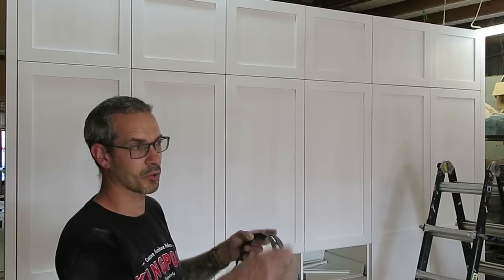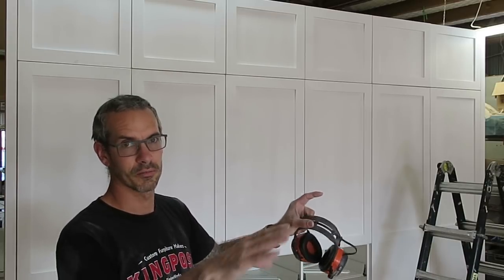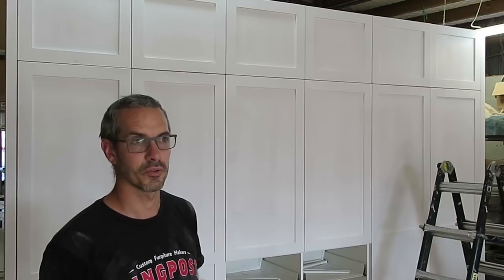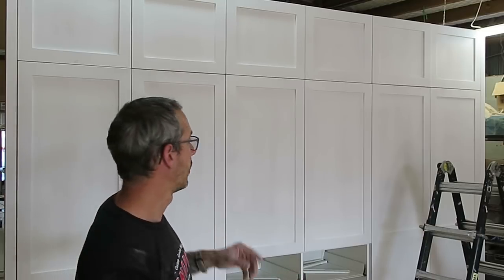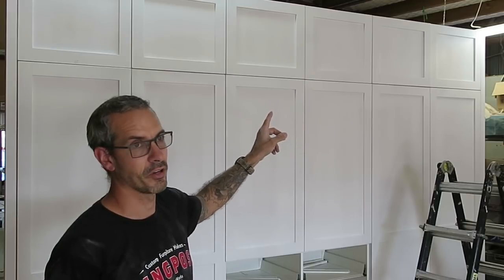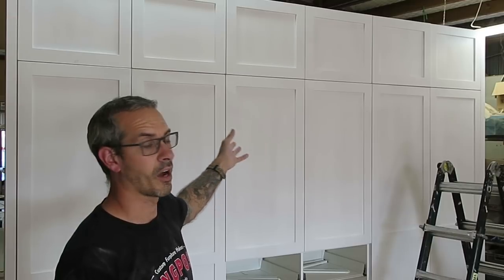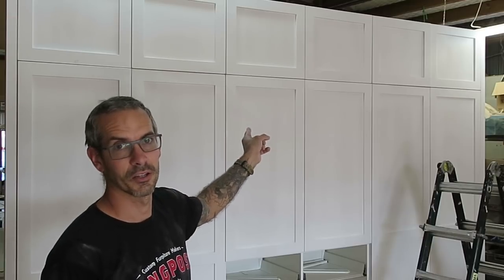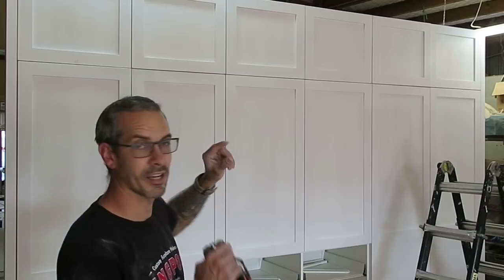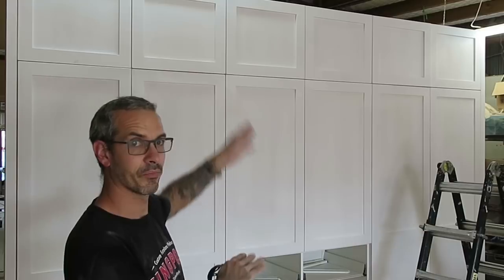For a kitchen where there's just one row of doors, typically under a bench, you can adjust as you go, as long as you've cut the doors to the right size. When you've got multiple intersections, it only takes a fraction of out-of-squareness of one of the doors, which is highly possible, and in fact I ran into it a little bit with my doors. It only takes a small fraction of out-of-squareness to stuff up all your lines.